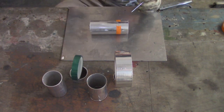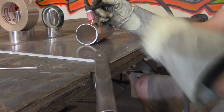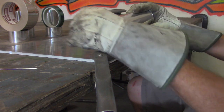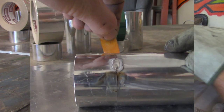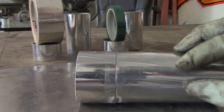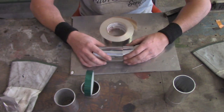We're going to tack them all up the exact same way — one tack on each side, 180 degrees apart. This is all 16 gauge 6061 aluminum. Notice on the masking tape, we pretty much just set it on fire and it becomes extra sticky — meaning it leaves this nasty residue behind. This residue is not something that we want to go back and have to clean up.